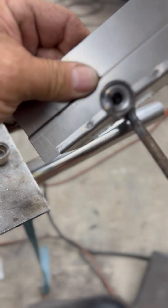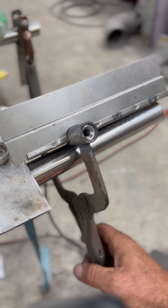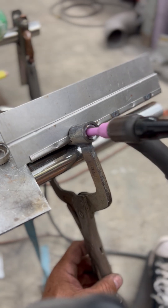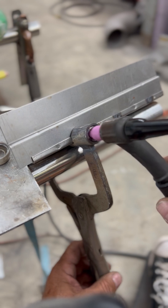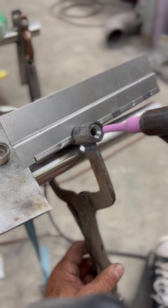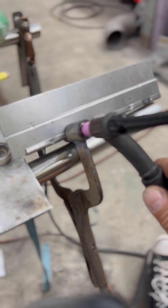The center of the sleeve is aligned with the hammer punch and punch mark underneath. Make sure that's in nice and snug there, and we're gonna do another test weld here. You can hear this bottom out — that makes sure that we're down tight to keep the heat in on the quarter inch flange. We're gonna go for about six seconds at 65 amps.